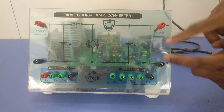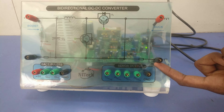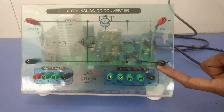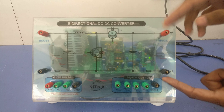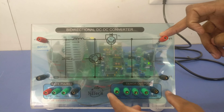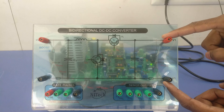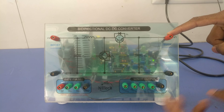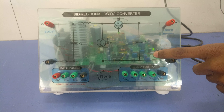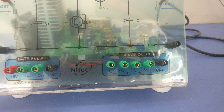For the boosted output, since the output is more than double the input — approximately 80 to 150V — when 150V is generated at the output, I get 3V at the sensor output. Similarly, for the output current in boost mode calibrated at 3 amperes, whenever 3 amperes flow at the output side I will get 0 to 3V here.